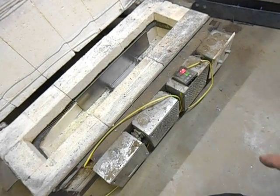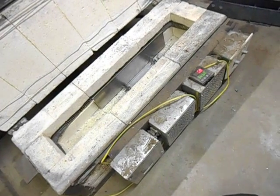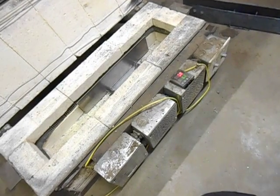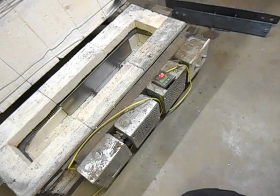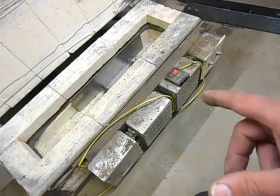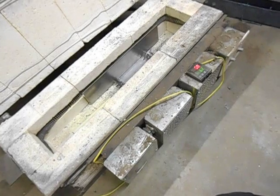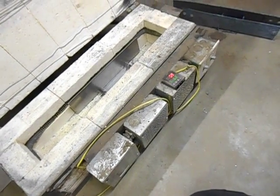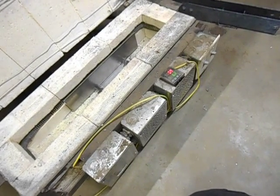And that's where the modification comes in that I made today. Heat treating high carbon steel, you're heating stuff up to 1500 degrees or so. You do get some scaling of the knife blades and any fixture that you have inside the kiln to hold the blades upright and in a position where you can grab them real easy. When I started going to the stainless, the 440C, I have to go back and look at my notes, but that's heat treated up around 2000.